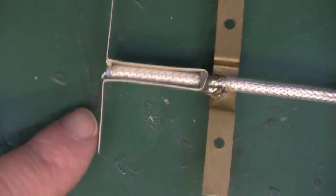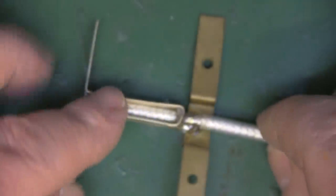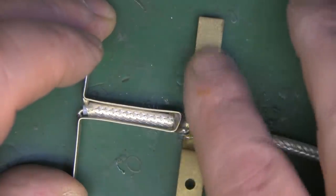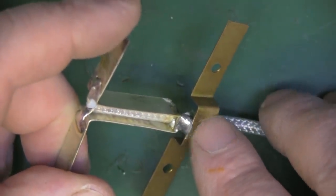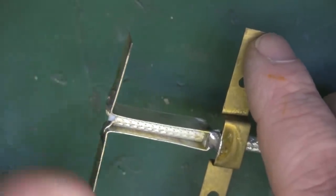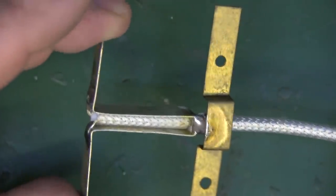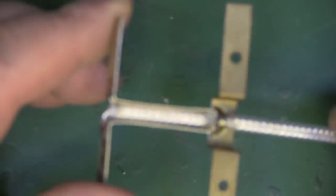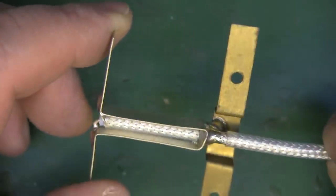Here's a closer look at the setup: you've got the dipole with the two feed points connecting to it, and then this folded balun below, connected to the ground plane of the outer braid of the coax. The reflector at the back is also soldered to the outer braid of the coax. So the main reflector and driven element are grounded together, but each of the parasitic elements on the rest of the boom are not connected. I have never come across a balun or element on a Yagi constructed in this way.